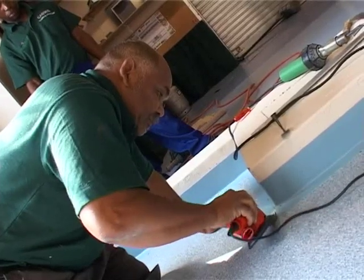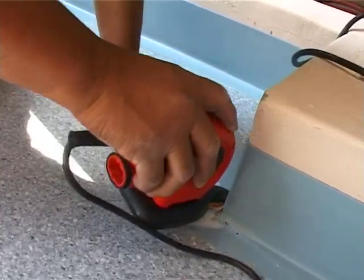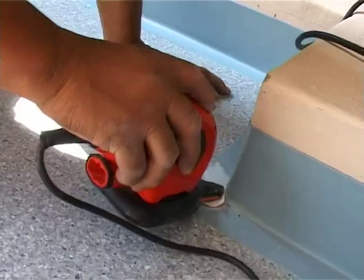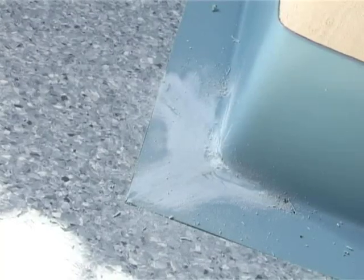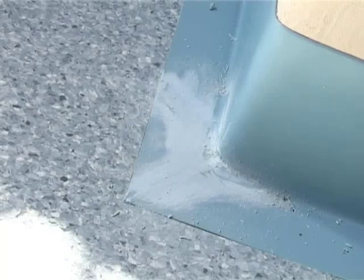Please don't confuse this sanding process, which can take place on the skirting, and do not use this on any of the sheeting, which will be a PR coated product, as you will not be able to remove the sanding marks.